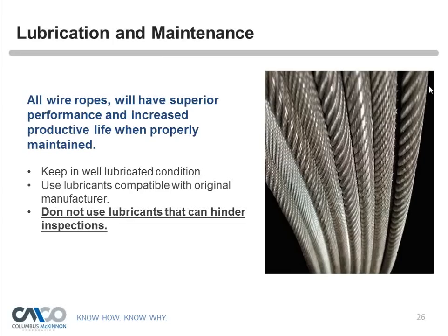Lubrication is critically important — like chain on a hoist, you can imagine all the individual wires dry under extreme tension having to adjust and move; that generates enormous heat and wear. Lubrication acts as a buffer between those wire surfaces, minimizing friction and wear. Inherently with operating a hoist you'll have surface-to-surface contact, so wear will happen, but proper lubrication and cleaning will minimize it and extend the wire rope's life.